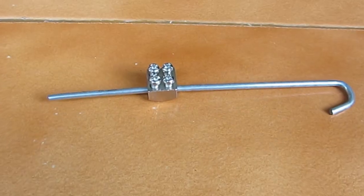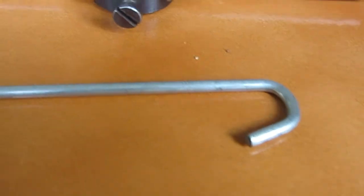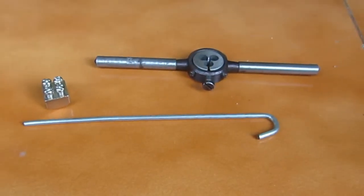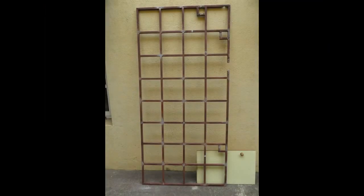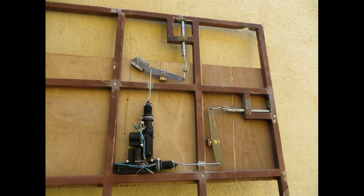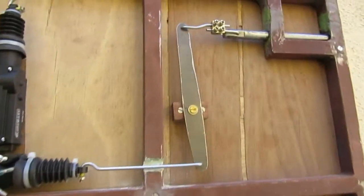There was a need to rework the wire linkages supplied with the remote lock kit, to suit the lengths at each bolt. These linkages were reworked by cutting the links, bending, and making fresh threads. The welded grid weighed around 12 kg. Once again, the working of the locking system was checked on a mock-up with the grid and actual levers and bolts.